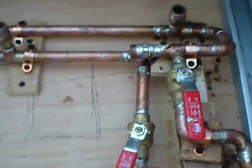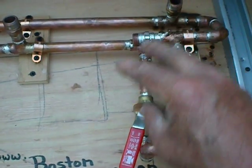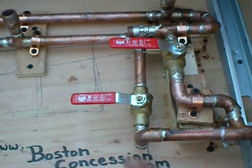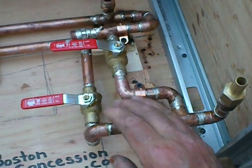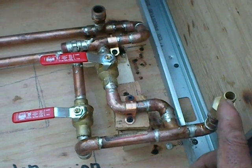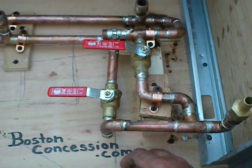So, in summary, cold water and hot water coming to valves that stay closed all of the time, then each of those tapering into one and all pitched into a braided line, which will get a hose clamp and a soft line and go out into the world.